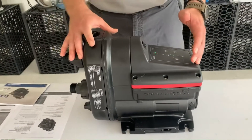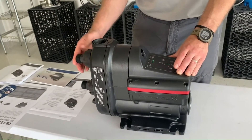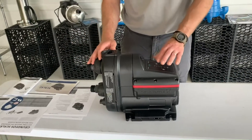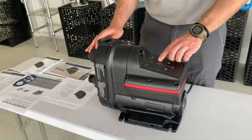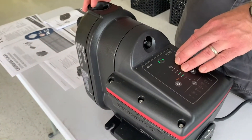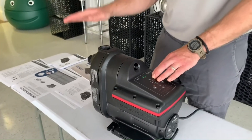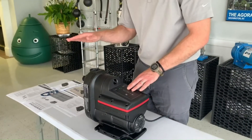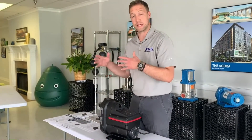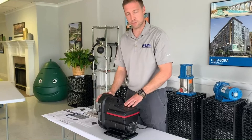The neat feature about this pump is it's a constant pressure pump. So it senses when pressure loss is on the other end — we call that an on-demand pump. By constant pressure, what that means is that it'll constantly try to keep up with any opening faucets. Let's say one faucet opens: it's going to cut on and ramp up speed to match that output. And then if we have multiple faucets open, it's going to ramp up more to match all those other faucets opening. So this is called a constant pressure system.